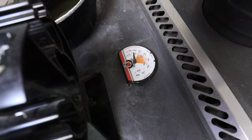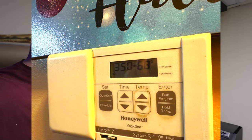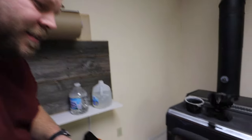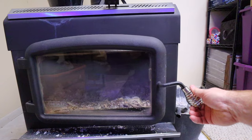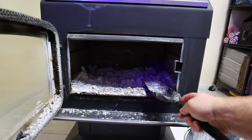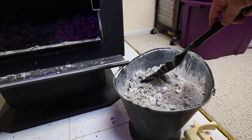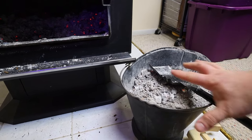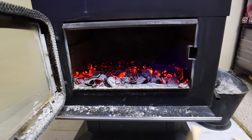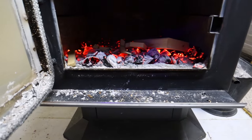It's four o'clock and the stove temp is about 185-190 degrees. That little fan is still going. We need to add water to the pot. It's 68 degrees in the house - not too bad - and it's 12 degrees outside now. I open this door and just crack it for a little bit, slowly open it, pull my bucket over. Then we take out this little bit of ash in the front. When you set it down on the bucket, set it at an angle so it slowly tips back and doesn't send ash flying up in the air. Pull all the coals to the front, same as this morning. We're going to add some kindling, but I'm going to do it a little differently because it's 68 in the house and I want to heat up quick.